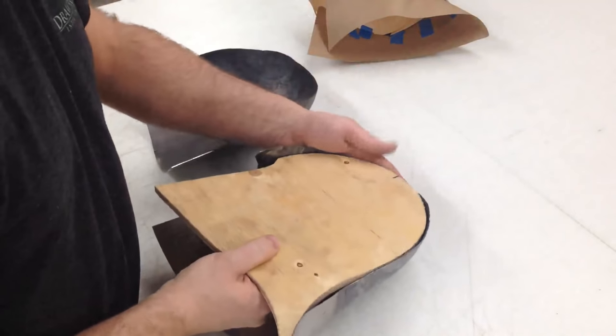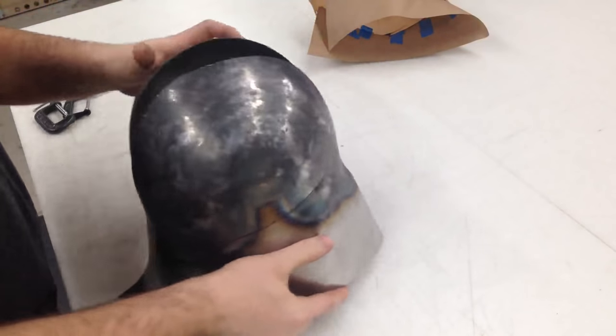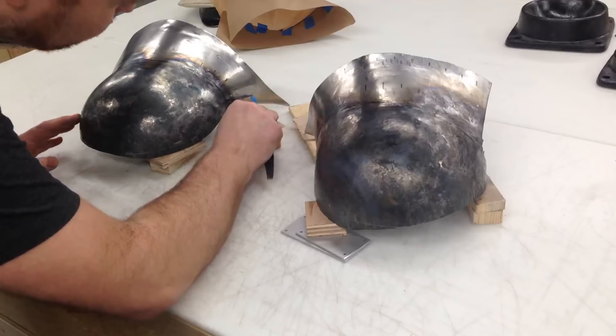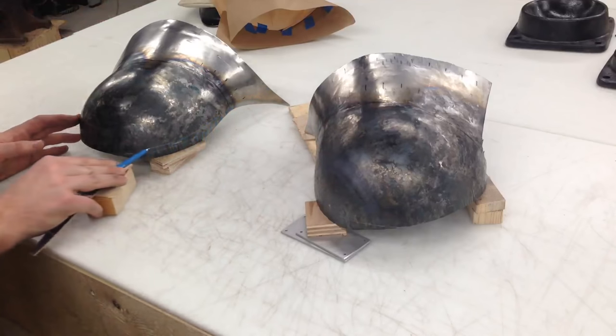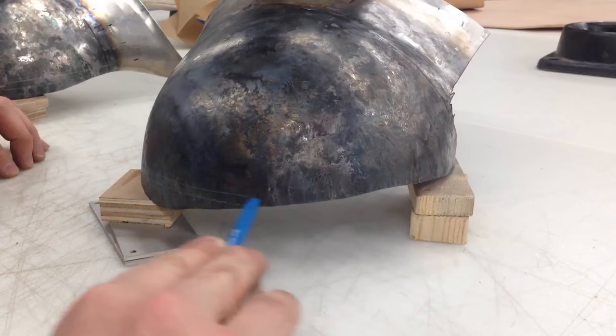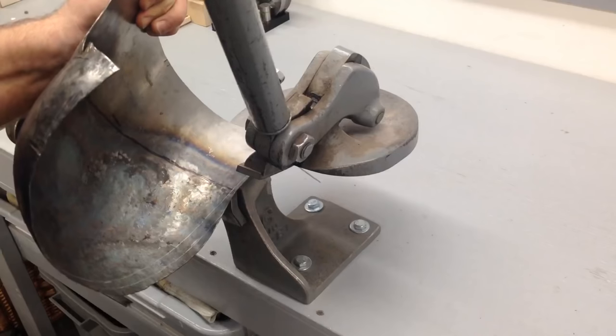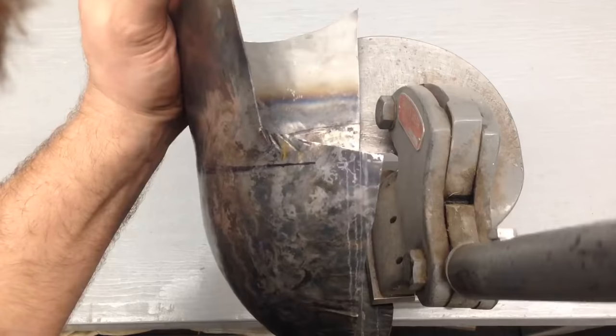Now that the one line is on there I want to match it exactly, so I measure it quite a bit and get the line marked so that the second half has the crease in the same spot. I rough in the crease using a weighted rawhide mallet, then switch over to a heavy planishing hammer to smooth it out on either side of the crease. Here is a quick test fit of the two halves just to see where it might need to be modified. Before I can do those final tweaks I have to get the two halves together, so I'm going to cut them so that they have a finished edge — back over to the Beverly shear to cut them nice and straight.